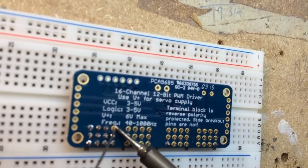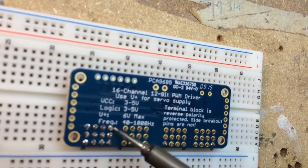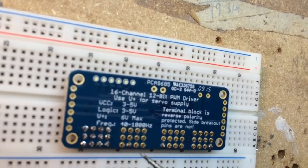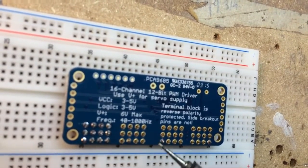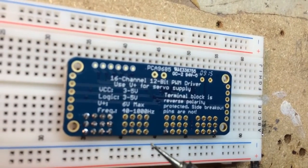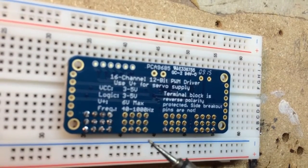The key is you don't want to use too much solder, because if you do, the solder will jump from one terminal to the next and cause a bridge of solder, which will cause a short circuit and basically won't let the servo work properly. You've got to use just enough solder — it kind of comes with learning over time how much to use, but a little bit goes a long way.